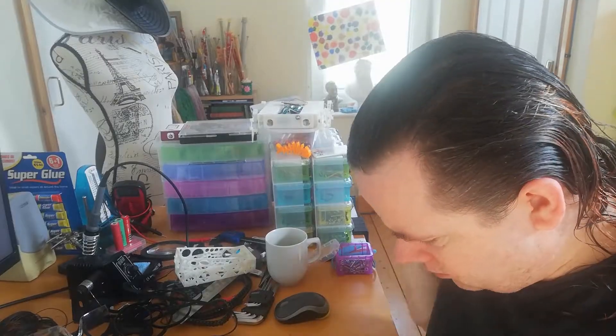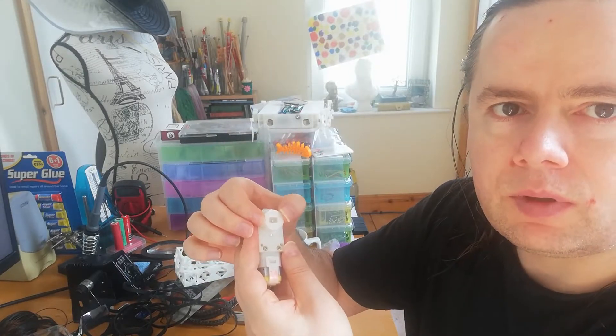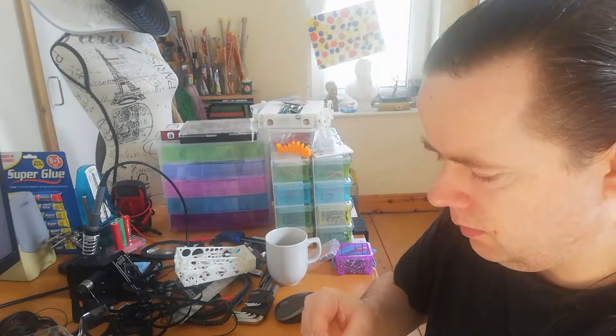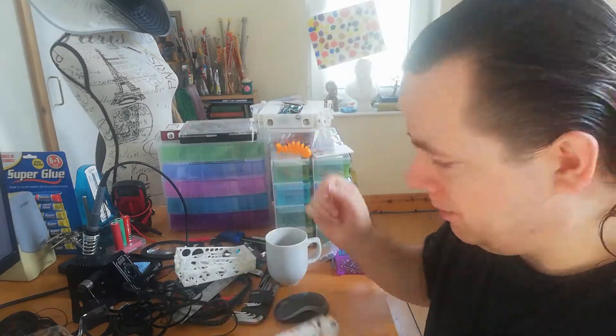Before I print the other side I'm going to redesign those little elements. I've just printed the new pulley, which is the right size for the motor — it fits, with a very small bit of play that shouldn't cause any issues. I'm going to clean it up first and then measure the track to see how much track I actually need in the loop.